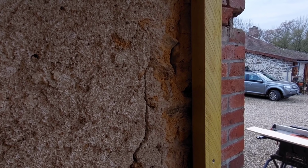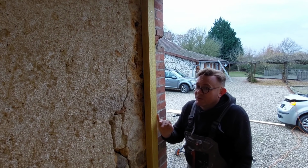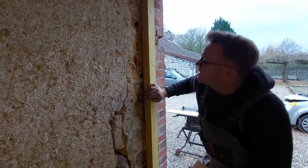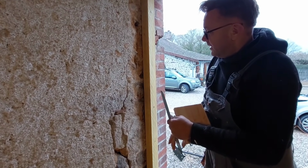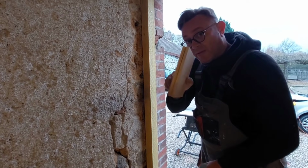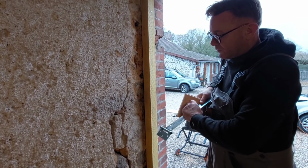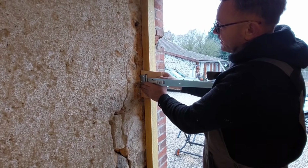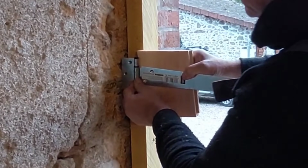And these doors are fairly heavy when they're made up. So I'm just having a think about how I can do that. I had a think about this. I think my only solution, which I don't want to do, is to put a strap of timber down on the inside of this frame, and I'll beef this frame up with a few more anchors just to make sure it's really solid, because I'm going into the brick. And then if I can come out the thickness of the door just on all of this side here, I can then screw these 4 hinges effectively into that. When the door is out, it will still close on this. It'll be incredibly tight though. There's not a great deal of space.